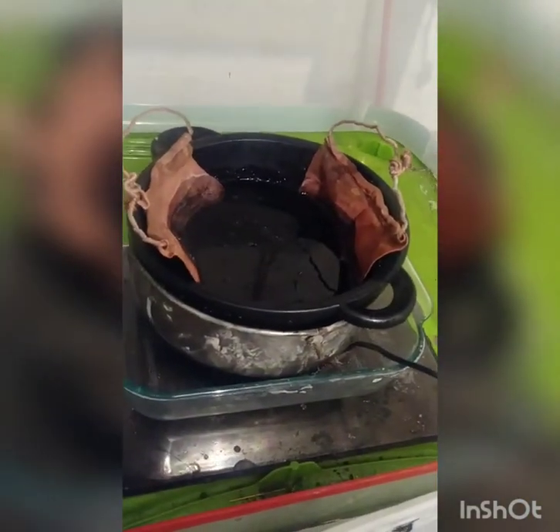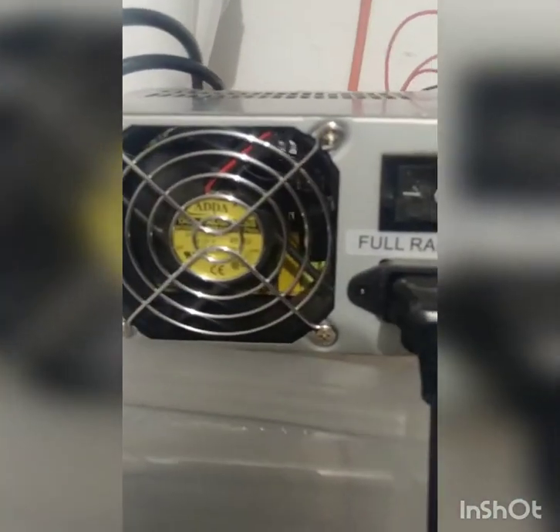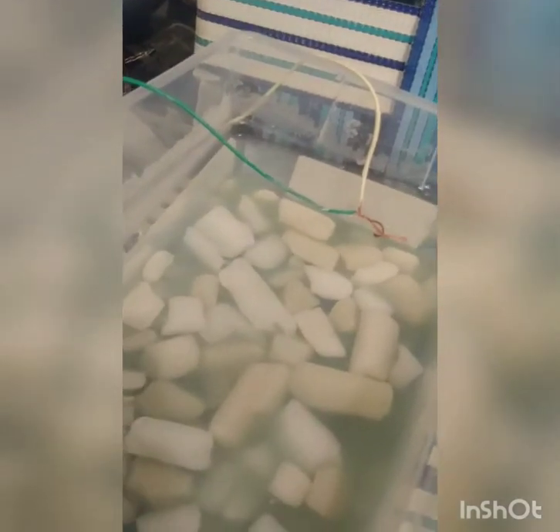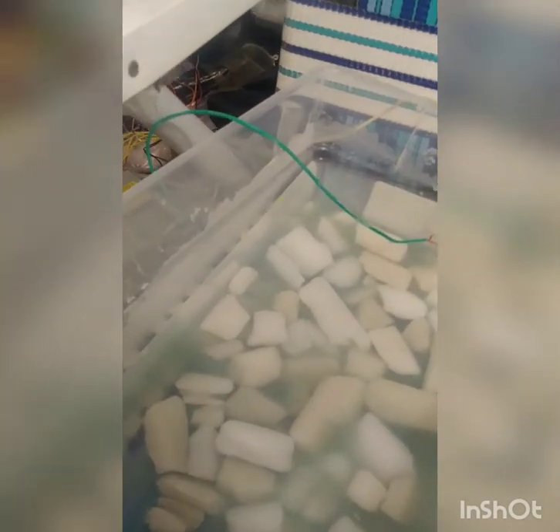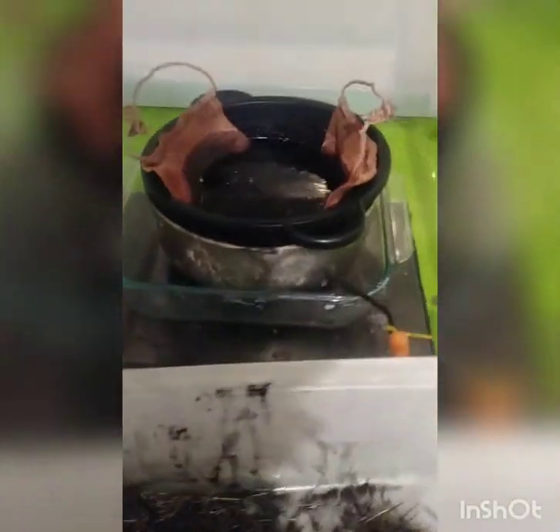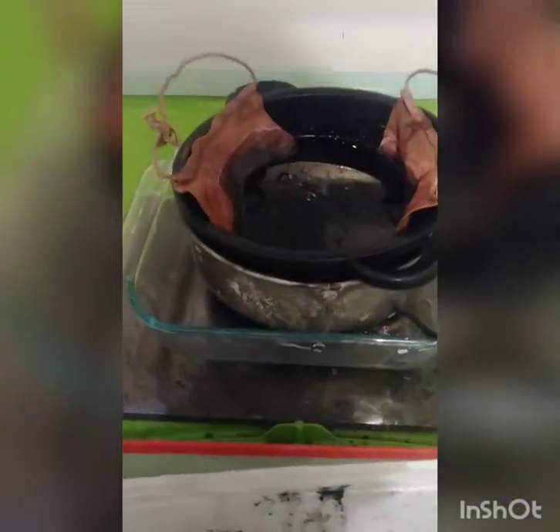Another thing I noticed was my hot wire would actually get hot — I could feel it — and I didn't want to burn out the power supply. Jeff Massey suggested filling a container with salt water using potassium salt tablets in a saturated solution. Both hot leads — one going to the power supply and one to the cell — are placed in there. Bringing the copper pieces close together makes it fizz in the water, which lets you control the amperage and prevent overheating.